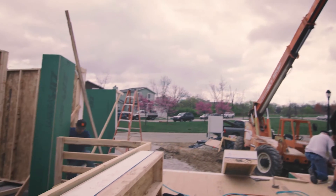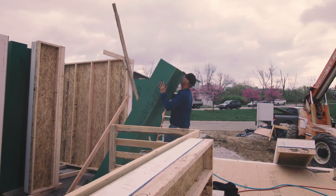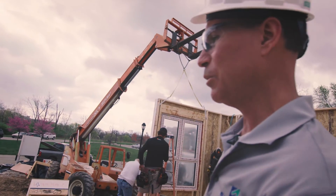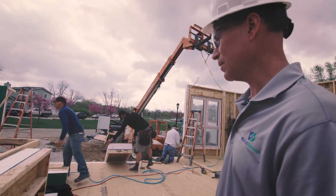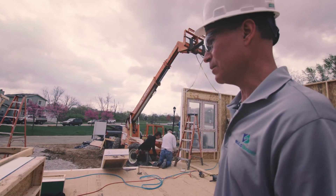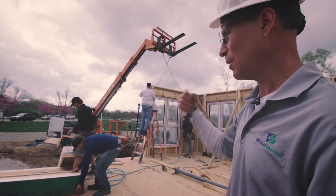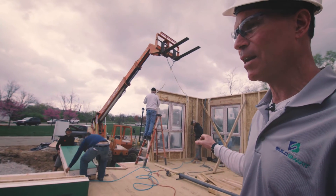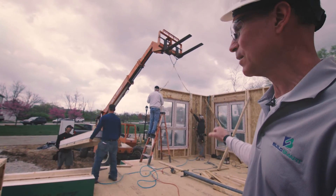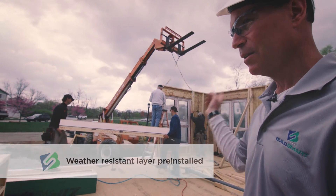They're like giant Legos — this is a giant Lego system where you plug together component panels that have all the structural components, the air barrier layer, the insulative layer, and the exterior water-resistant layer all in one system. By doing it this way, the carpenter crew doesn't have to stick-frame anything — it comes pre-framed structurally. They don't have to install and airtight the windows on site, or wrap the insulative barrier and zip wall on the exterior. It's all pre-done.